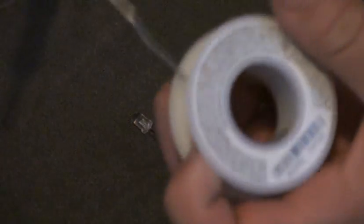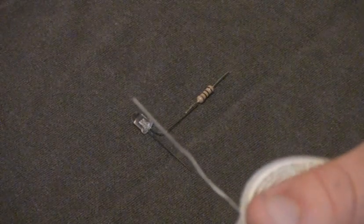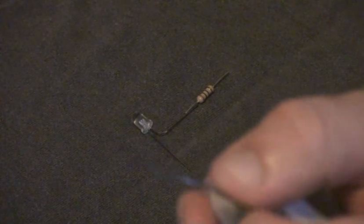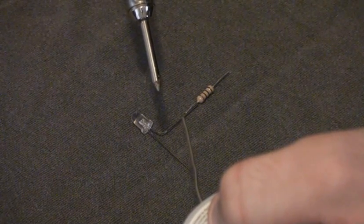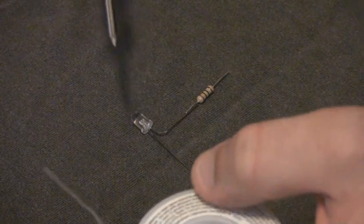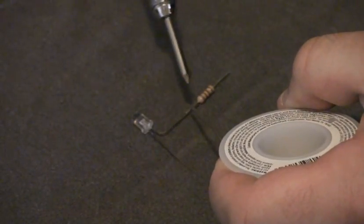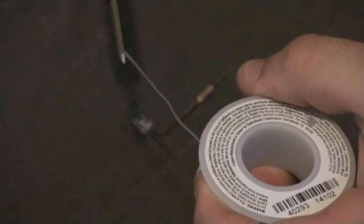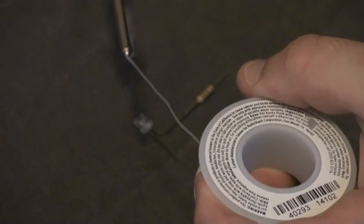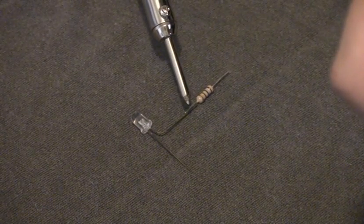Before we do that, I like to hold the reel with the solder sticking out for control and stability instead of just holding the wire loosely. If you've never done this before, I highly recommend practicing on a couple of wires until you feel comfortable. You can either hold the solder down where you're going to solder and use the gun to melt it, or gently touch the tip of the gun with the solder to melt it onto the tip — then just touch the connection and it should solder.